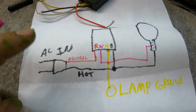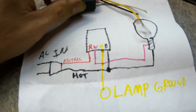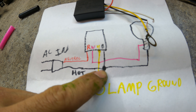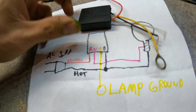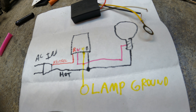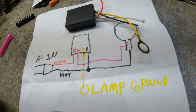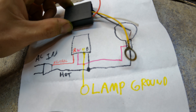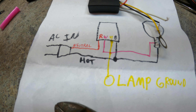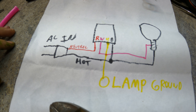Here's the wiring diagram that actually works. So we got our AC coming in - neutral leg of the AC goes to the red wire. That could have been white - people who made this, that could have been white, made more sense. Then our hot - all the hots get hooked together - goes to the black wire, which is the right color for National Electric Code, and it goes to the center of the bulb. Then my pink line represents the white that goes to the threads of the bulb, the neutral. And yellow goes to the ground of the lamp. Maybe the first two worked a little bit and then popped because of how AC - alternating current - can sort of be switched.